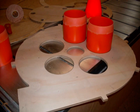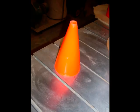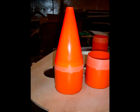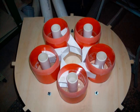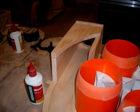Next up we have the upper body of the cyclone, just sizing up the positioning of the cyclones. Here's one of the cones that was cut up and neatened up to fit on top of the larger PVC pipe used for the upper part of the cyclones. From there, a hole was cut in the side of the cyclones to put the inlet pipe in, and the five cyclones were placed in a circle to help the air go through smoothly. Here we're looking at the inlet pipe for the upper unit.